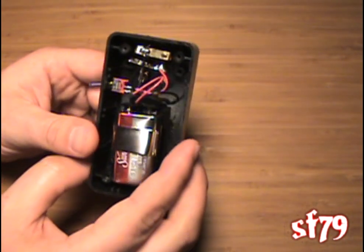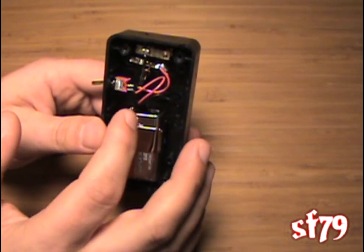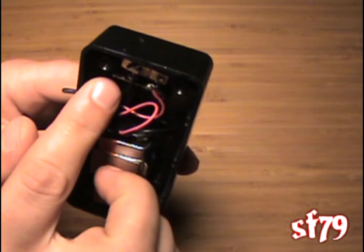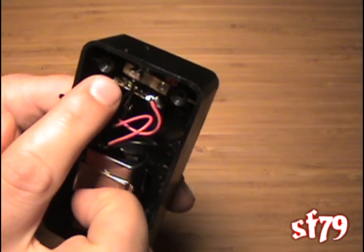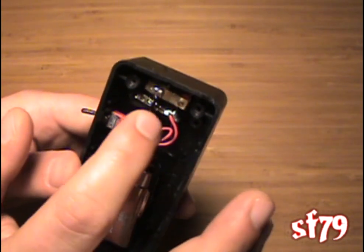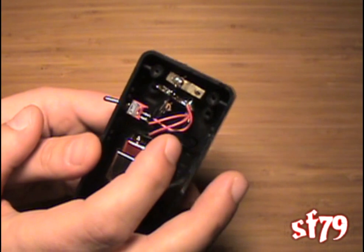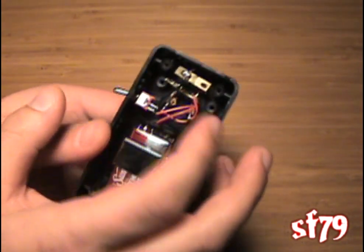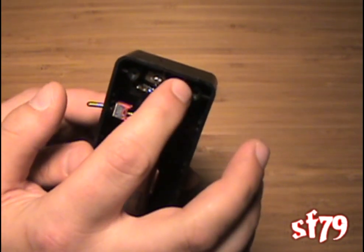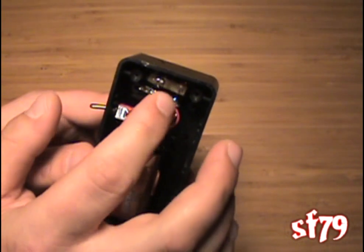Here's how this is done. What I did was went ahead and built both of the circuits, then I took a piece of metal — bring it a little closer so you guys can see — and I soldered each one of those to that piece of metal. From that point I've turned these two individual circuits into one. I went ahead and done the same thing with the LED side: I took a little piece of metal and soldered both ends to it to create one single circuit.